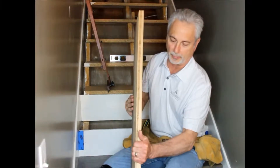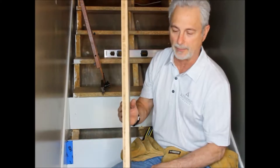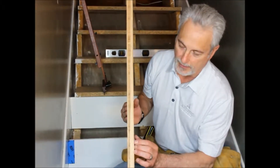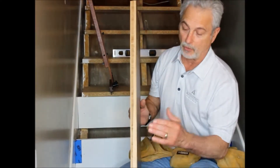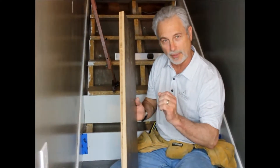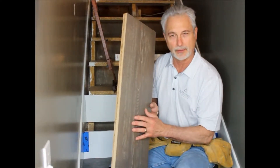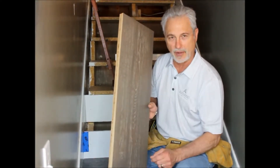I've already done a pre-cut on the back so the width is acceptable for the size of these steps. It was a two-part cut: first a square cut, but then also an angled cut so that when we drop it down into the riser it'll make it a little bit easier. Remember, we're dealing with pre-finished products that are custom blended to a particular manufacturer.